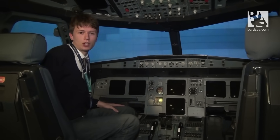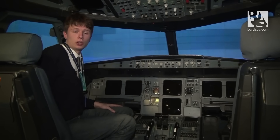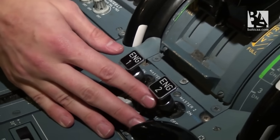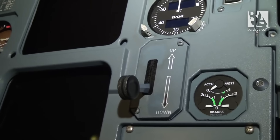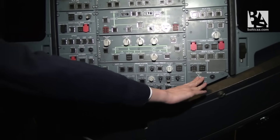You can see that the aircraft is currently in a state which is called cold and dark. In order to select the power on, we have to do a few checks. We check that the thrust levers are at idle, that the engine masters are off, the engine mode selector is normal, that the parking brake is set, we have the gear selector down, and the windshield wipers are off.